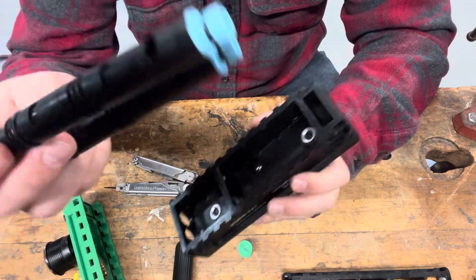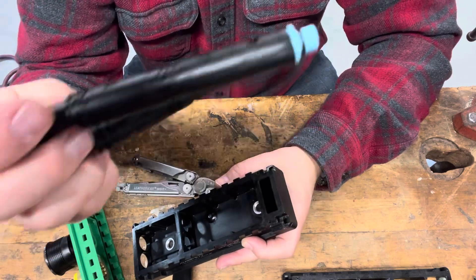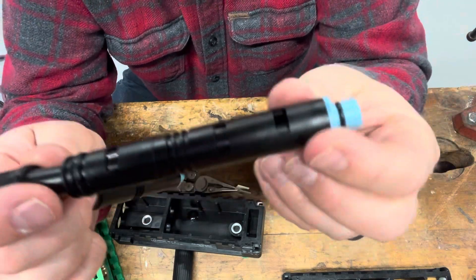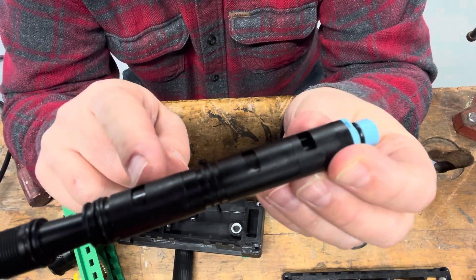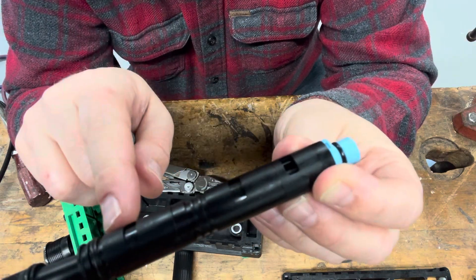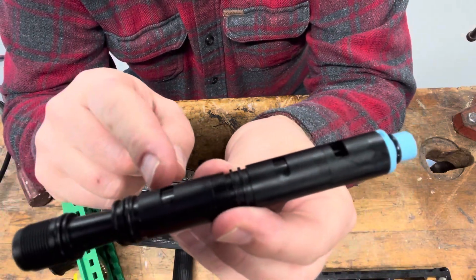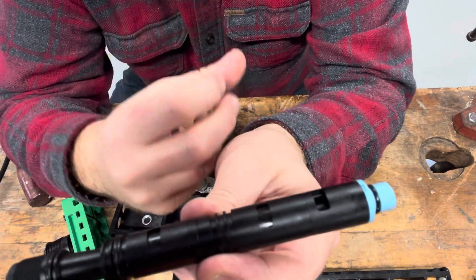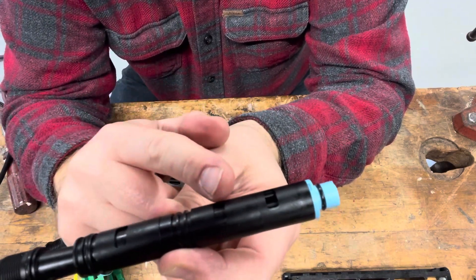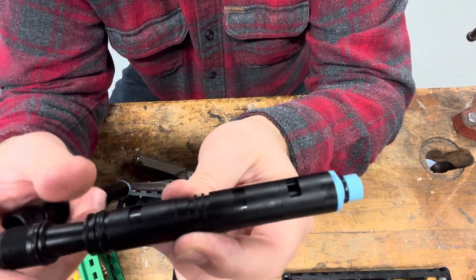That's an easy way to remove your cartridges. And once again, since there's no real mechanical parts in here, a lot of times these can just be cleaned out and then reused. Another thing to be mindful of is on here you've got these little flaps. This is where we get the three stages of a Piab Venturi cartridge. It's really important that on these, in order to get the larger or deeper vacuum, you need these flaps to be able to engage. If these flaps aren't there, you might get plenty of vacuum flow, but you aren't going to get as deep of a vacuum.